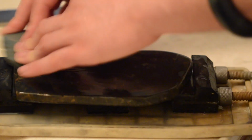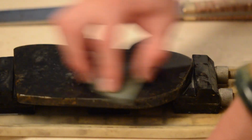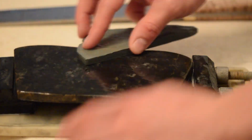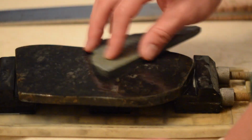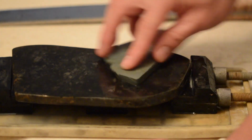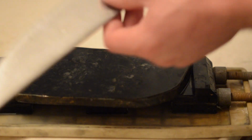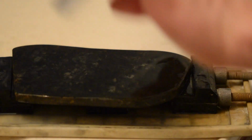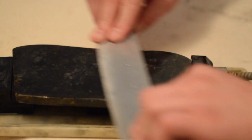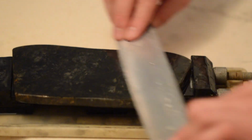And if you have slurry stones, these stones dress very nicely, so you can really rub in the polish, because if you want this thing glassy, silky, smooth for sharpening a straight razor, then that's the trick: keep your stone really smooth. So that's part of why I didn't scrape it again with the diamond plate in my demo. And I'm pretty satisfied by those results. I think I could sharpen this knife for another 5 or 10 minutes, just paying real close attention to what I'm doing. I sometimes get a little distracted when I'm sharpening and talking.